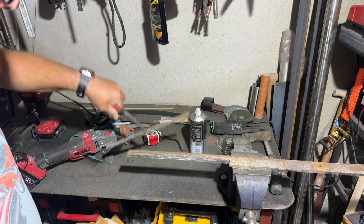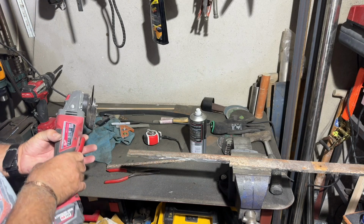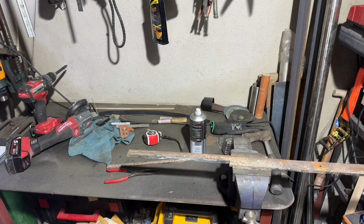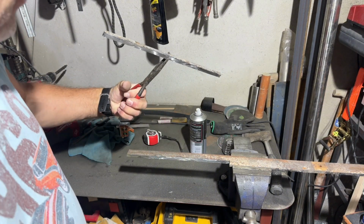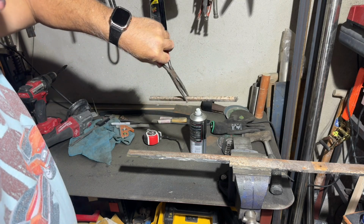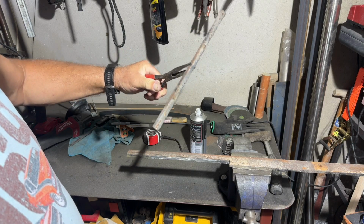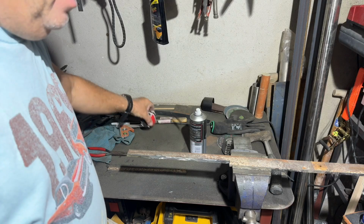Now it is very old steel, but if I do a grind test on this, just a moment. It's more or less similar to what we're actually joining, so it could be a bonus. What we're going to do now is clean that up with the sander in the vice, and then we can manipulate it into a semicircle or near enough in the vice, and then we can cut it, get it prepped up, place it in, and see how it welds up on there.